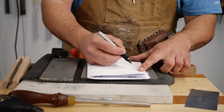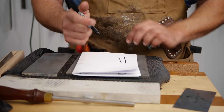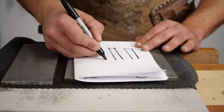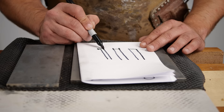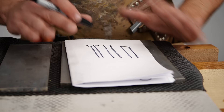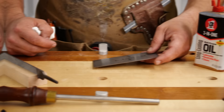The magic of a card scraper is in the way it works. When we sharpen, we take the card scraper and make it perfectly square, make sure everything's nice and smooth, and then we draw out the edges so they start to come up. Then we roll them over into a hook. On a microscopic level, this hook will grab your wood and peel it like a shaving — just like a hand plane, except it doesn't get tear out, which is incredible. We can create a hook on both sides.